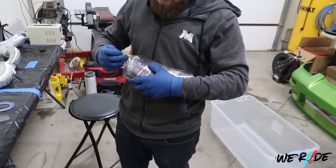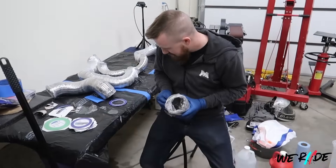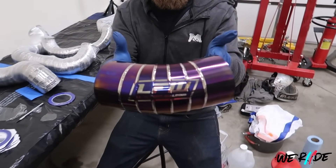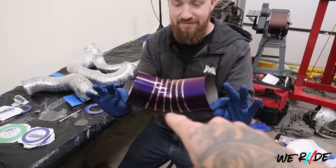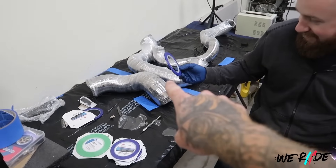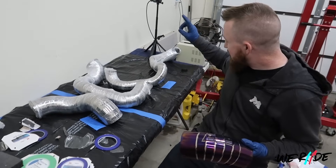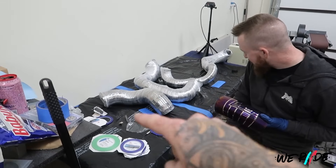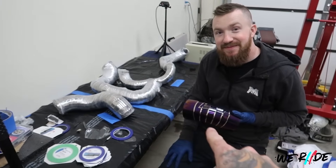So we did a little tester piece, which is actually going to be for sale — it kind of gives you an idea of what it's going to look like. And what a lot of people don't do with titanium is get it polished. So we took it to a guy that polished every square millimeter of all the piping, so it's just going to make that color pop more. Most people, when they color the titanium, they're using heat — like a torch to change it. This is a much more in-depth process. Here's the piping and you can see his logo on there, but the welds are taped off where it's still silver. So he has to take this 3M tape. There are about 70 welds on this one alone — probably close to a hundred to a hundred and thirty total. He has to tape every single weld precisely so it doesn't color the weld, so it leaves it silver like that to break it up a little bit.